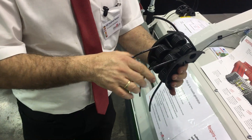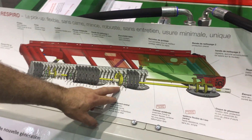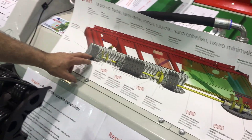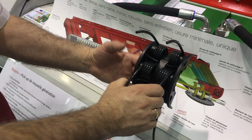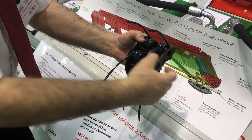We fix the second part and now on the design of the pickup you see the center gearbox. The center gearbox is driving the hexagonal shaft. On each side we have the double bearing, and this is linked to the shaft with the second half. With the circlip we can fix it.